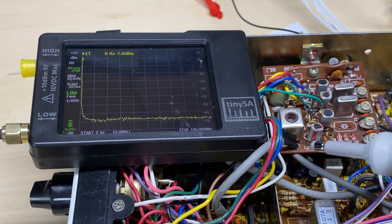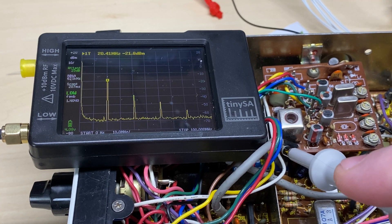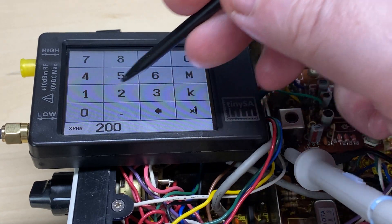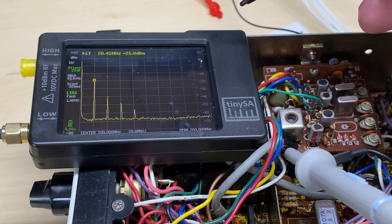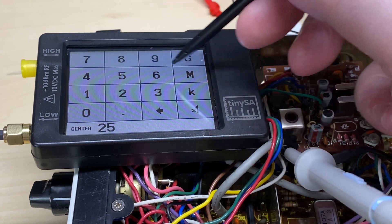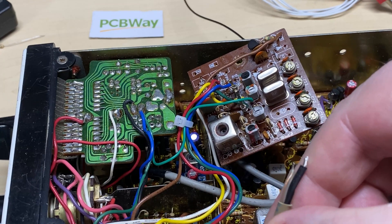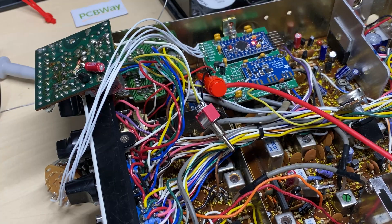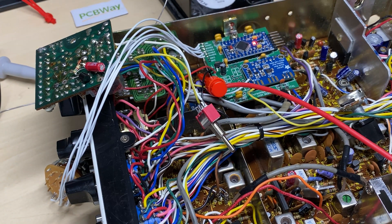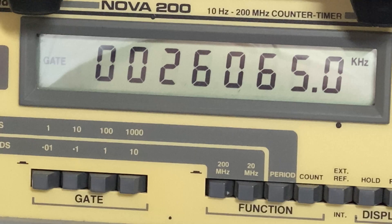We're going to have a look at the output of the radio's original crystal board — and there you can see the three harmonics coming out of the crystals. So it's not absolutely clean coming off the crystal board anyway, which doesn't bother me too much. Hopefully there's filtering further on in the radio which will stop this. That's our oscillator board output which we will be injecting our signal into. We've got a voltage meter on the VCO just to check — we've got a decent VCO voltage and everything seems to be working just fine.